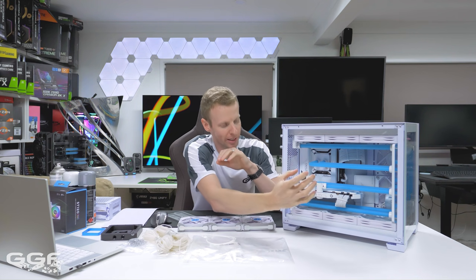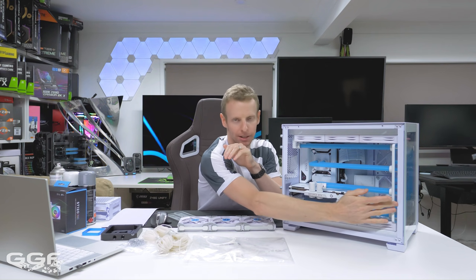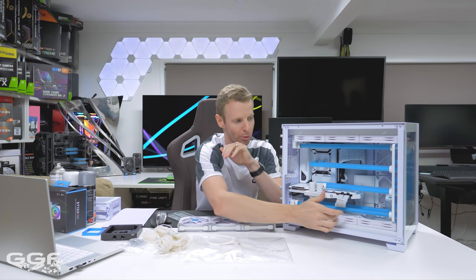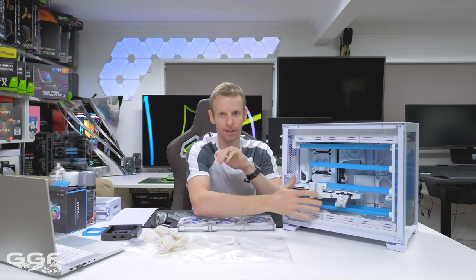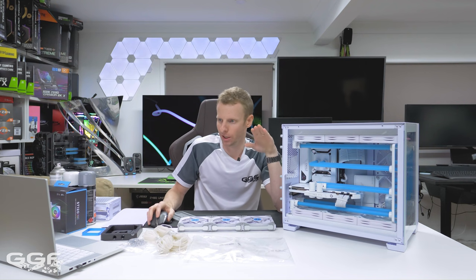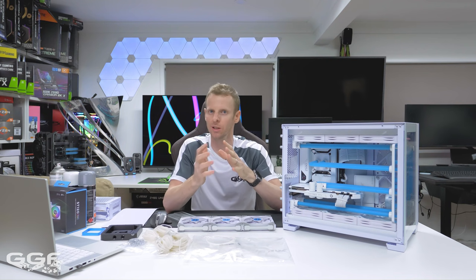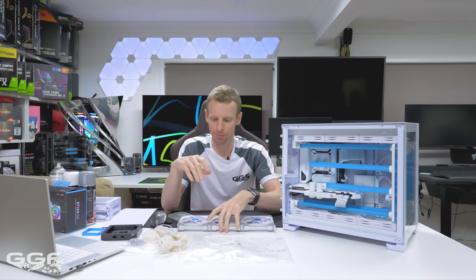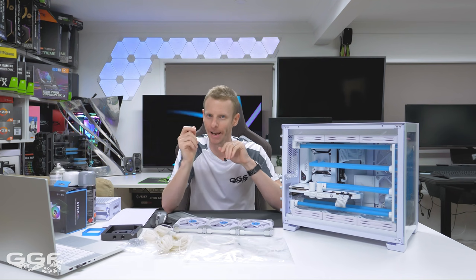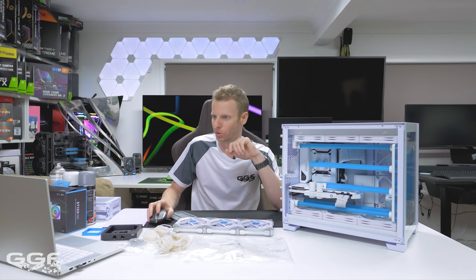I had to install two fans on a rad at once, slide the rad in because the distro had to go in first, then install the last fan, same with the bottom and the top. So you couldn't install all three fans on the radiator and then slide it in, it just wouldn't fit. So I'll explain that reason. Fan choice is another reason, mainly because I went so many times to try and get the right type of white when it comes to fans. I can't believe how many different types of whites there are when it comes to those. And also bottom fans blowing out. A few of you guys have asked why I did that. And then I'll follow up with temps. So quite a lot to cover.